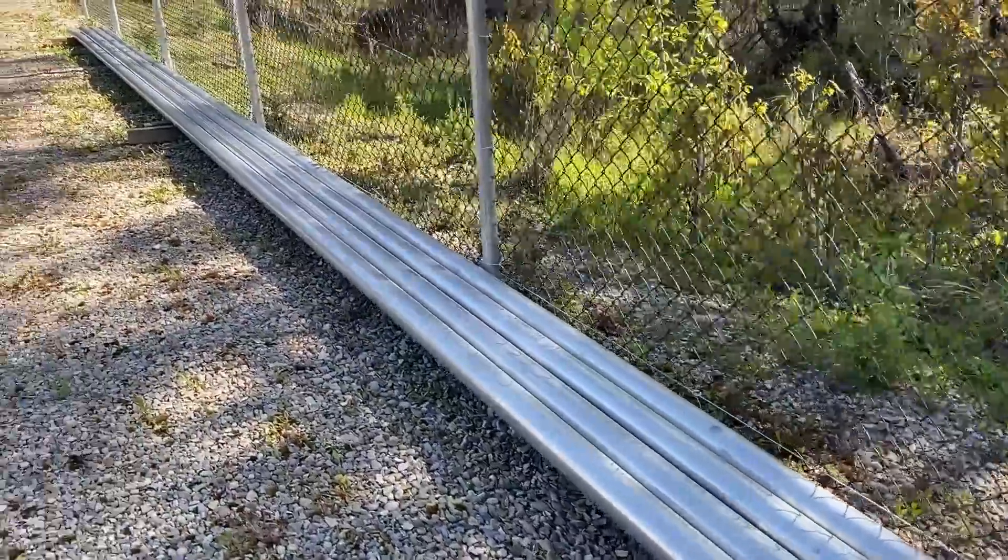The vertical I'm building is the third element in my directional 160-meter parasitic transmitter array, and each element is 75 feet high and top-loaded with 40-foot opposing wires to bring them close to resonance. Therefore, I need to splice a 40-foot length to a cut 35-foot length.